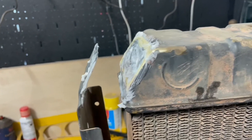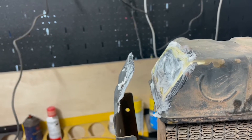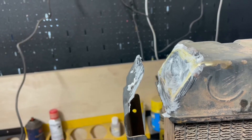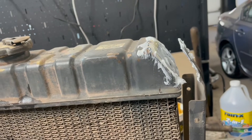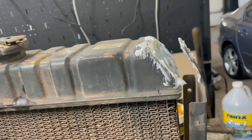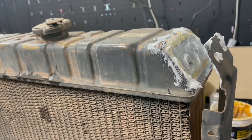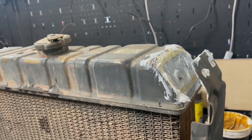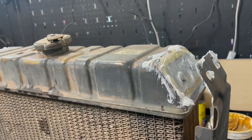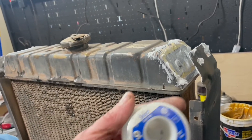You don't want to overheat these areas — right now we're just heating to clean. In terms of solder and flux, you want to lean towards plumbing-type stuff — acid core, I would prefer. I just happen to have whatever I typically use for plumbing here; I didn't run out and get anything special. I would not recommend using stuff geared towards electrical soldering. Go to Lowe's, go to the plumbing section, get yourself some acid flux and acid-based solder — that's how I've always done it.